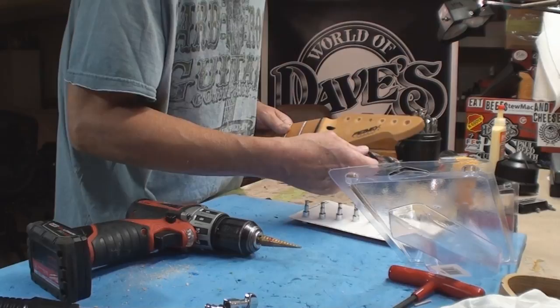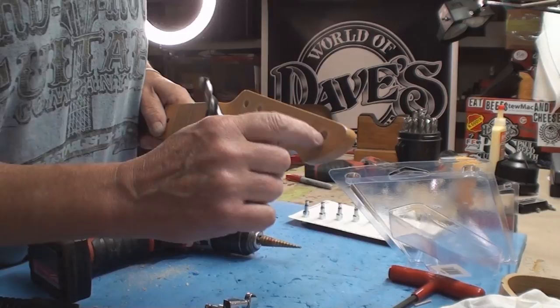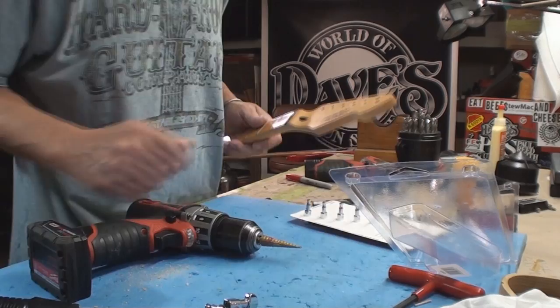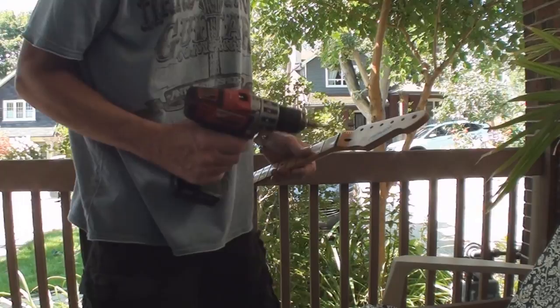The other thing that'll have to happen is finishing with a reamer to the right size once I open that up. You don't want to go in 13/32nds, and there's always going to be a little taper from the stepper bit even if you work it from both sides. So we'll finish them off with that. I've got to go outside — I'm out on my front porch.